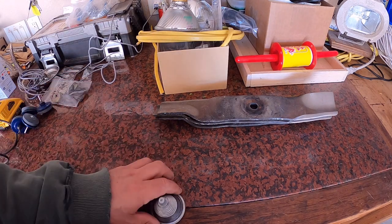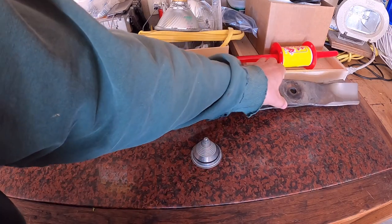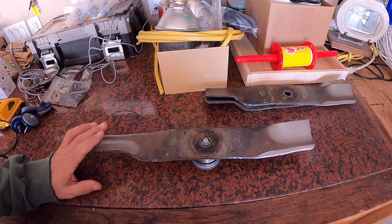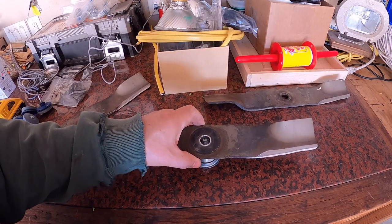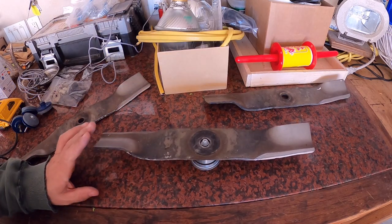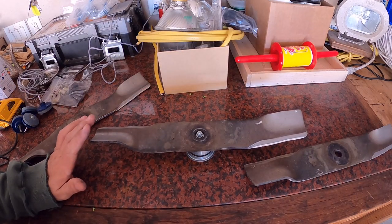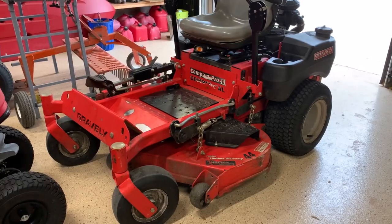When you're done sharpening, you might want to try one of these things — it's a little teepee-shaped balance tool that you can use to check that your blades are balanced so they won't wobble under your mower. You're just looking for it to be sitting level. It works all right, but I rarely have to go back and fix them again — they don't get really out of whack, it's pretty close.